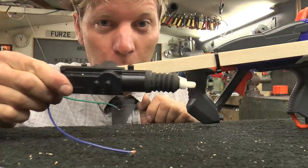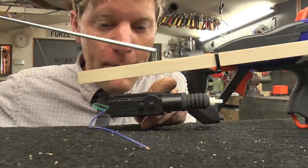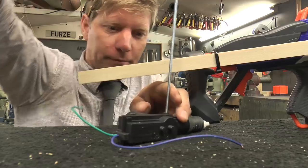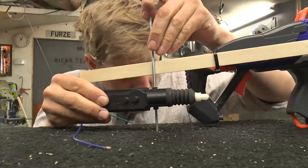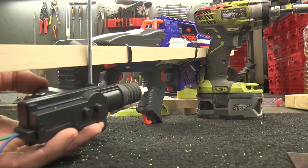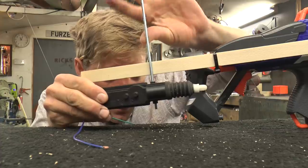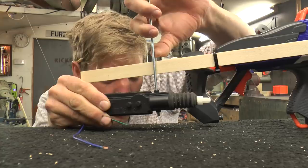I've drilled that out with a 4mm drill, because we need to mount this underneath here. Then we need to get our M4 threaded bar and feed that through the holes. There will be a little nut on the end, and then we need to suspend it level with the trigger. So look at where your trigger is, work that out — it's going to sit about there — and then we need to chop the bar off somewhere around there.